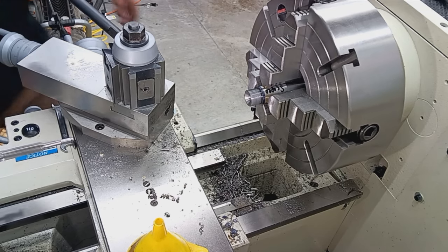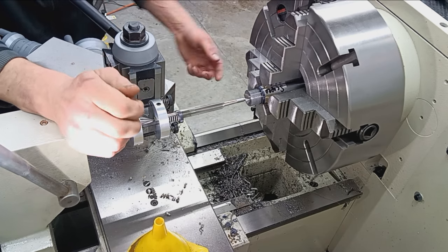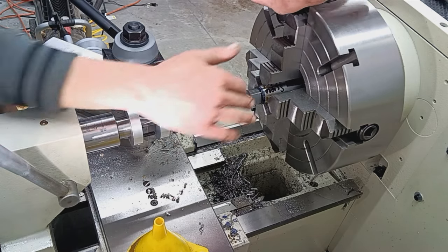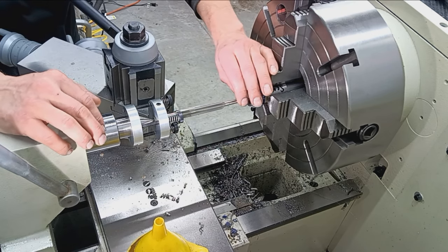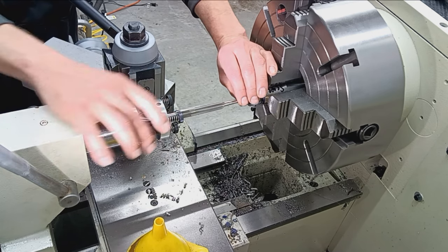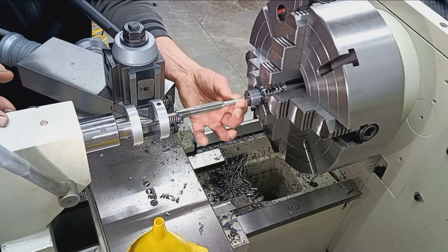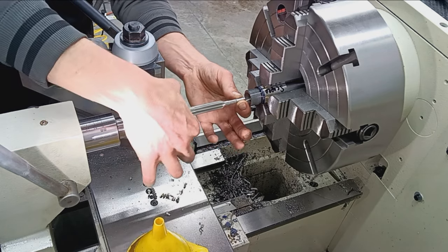Okay, here we go. I got my 6.5 PRC finishing chambering reamer made by Manson, a 0.2560 live pilot, which happens to fit this bore perfectly. The reamer is roughly set up to enter straight. The way this holder works, as I said earlier, the back end here is held rigidly by a dead center. And then this contraption is a spring-loaded collar that allows you to kind of pivot your way in. So it allows a little bit of play up front. There's nothing in the back.